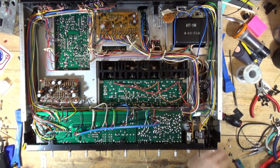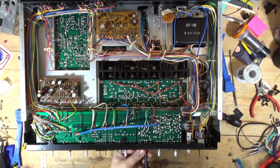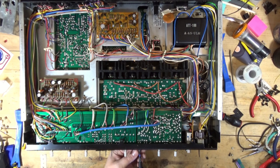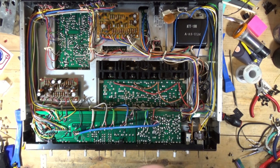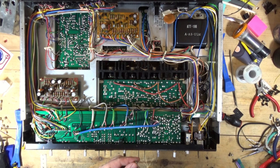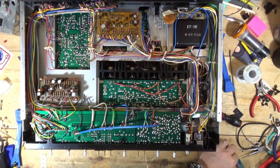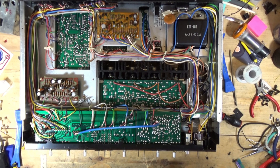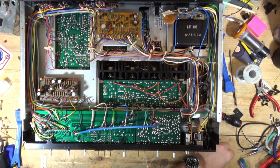After I do a board, I always test it and make sure that it's good. This re-transistorization — replacing the transistors — was successful. Those blue caps were 2.2 microfarad 25V. I didn't have any film caps, which is what I normally like to use in place of those tantalums, but I did have some electrolytic so I popped those in there and they were fine. I hit the controls again with some cleaner, and I'm going to call this board done.